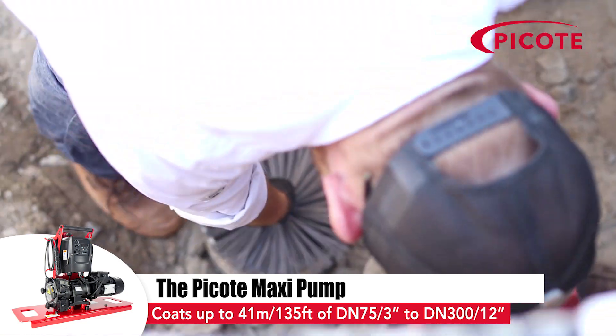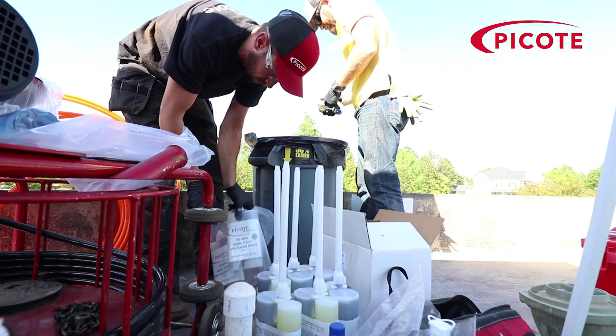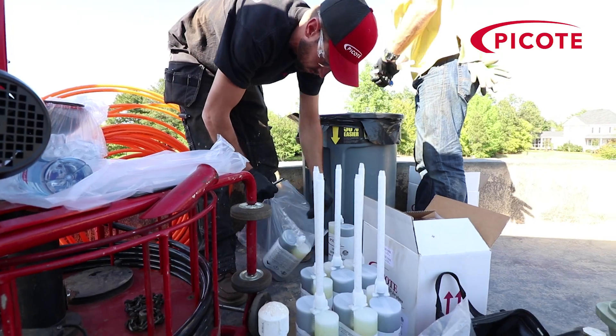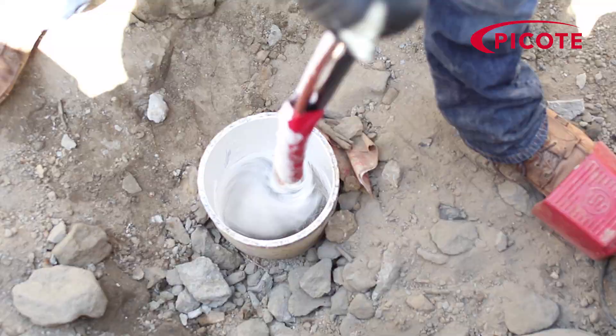There were only three joints in the whole pipe — one was a 90-degree — so we decided to put five coats on it. With it being an eight-inch line with a lot of pressure behind it for the fountain, because it shoots up about 15 to 30 feet, we wanted to make sure we were putting enough epoxy on it that we wouldn't get a callback to have to come out here and redo it.